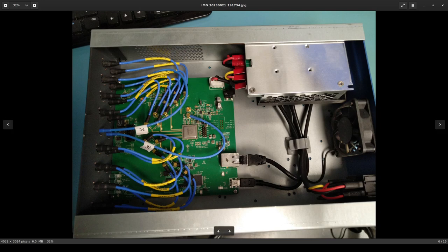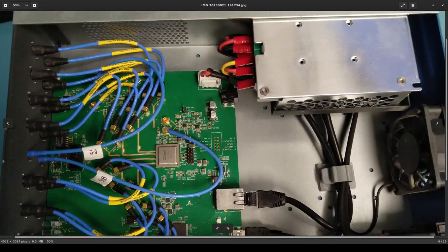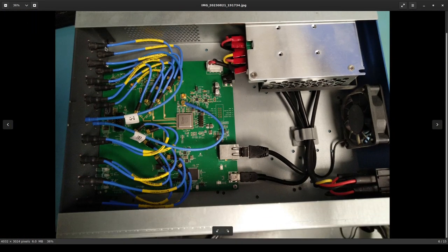This makes sense given that the vendor sells an ATE version with a very similar part number — they're probably the same board. The Ethernet connection has a little RJ45 cable going to the back panel, same for the USB, and mains power comes down to a connector on the main board. Zooming in, there's a barrel jack that's not being used in this version, but again, they're probably sharing the same board for both the ATE and benchtop versions.